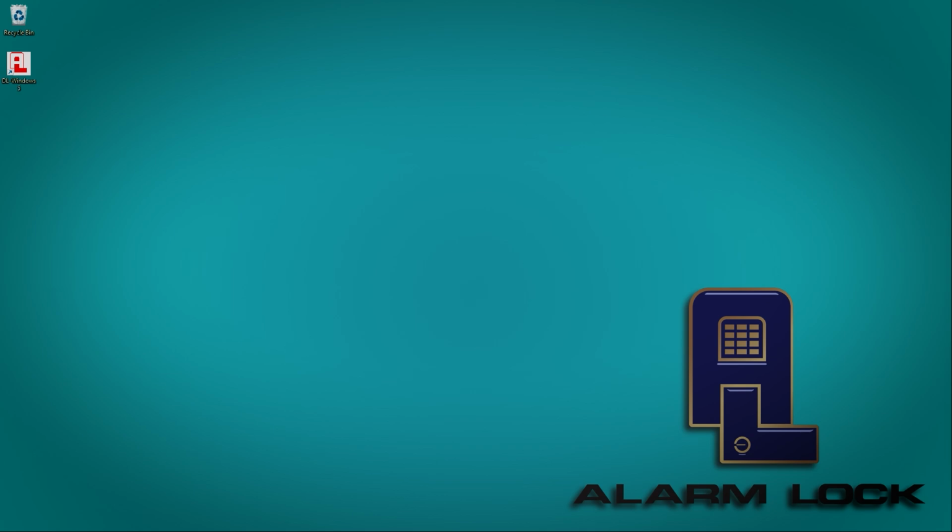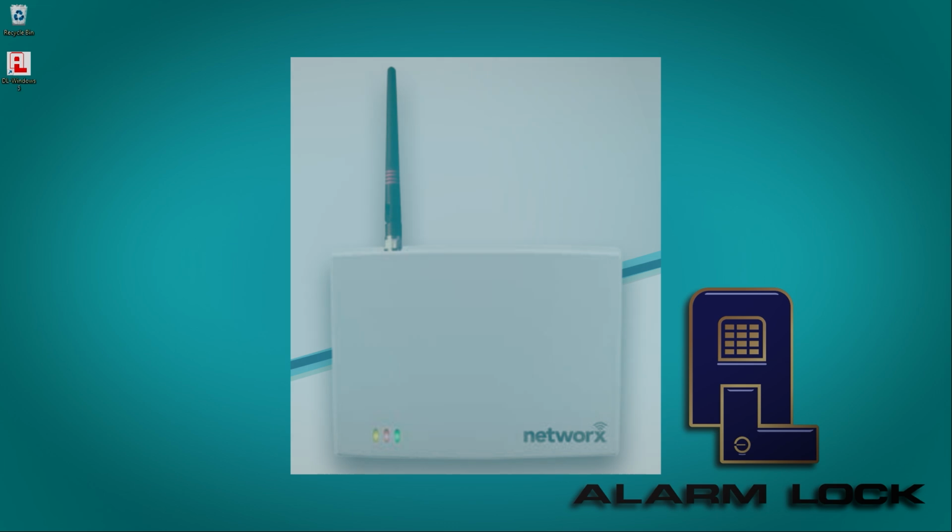Before you can add a Networx lock to DL Windows, you must have a gateway for the lock to communicate with. The locks do not work on Wi-Fi. They use a proprietary form of wireless communication that is only compatible with our alarm lock Networx gateways. We do offer gateways that can work with your local Wi-Fi, but the lock itself communicates directly to the gateway, and the gateway will communicate with your local network.